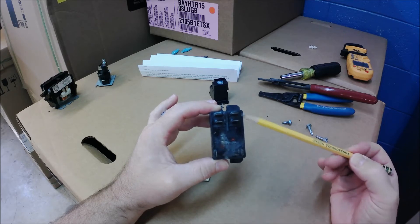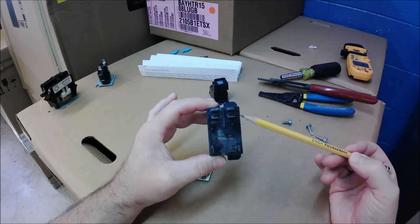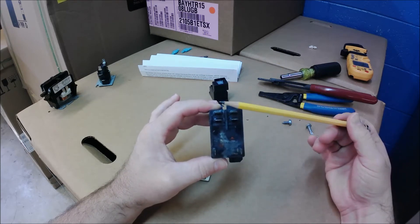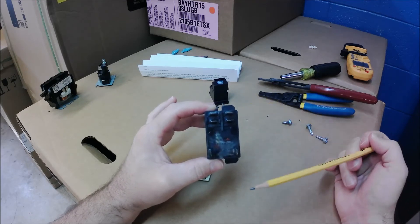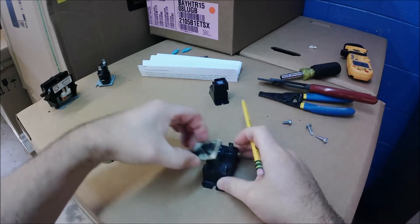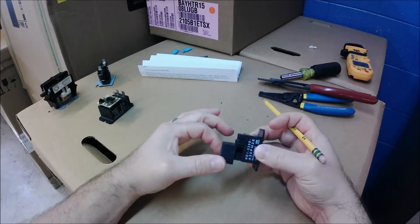This will do one heat strip — top to bottom. Power comes in, once the coil energizes the switch closes and comes out the other side. Likewise on the other side. So it's not left to right as you're looking at it — it's actually top to bottom. That's one style, and it uses DC voltage, not AC.